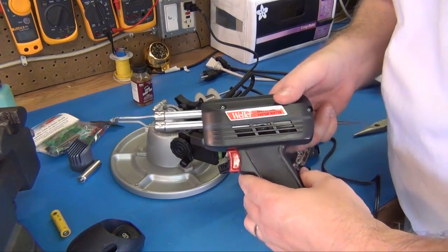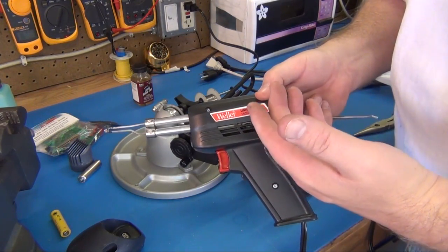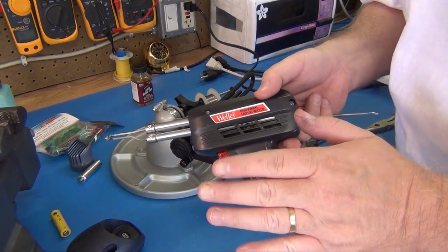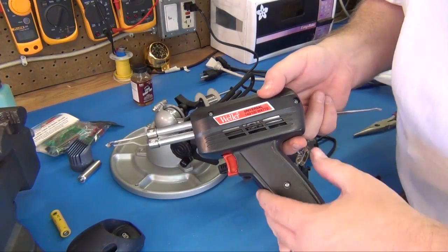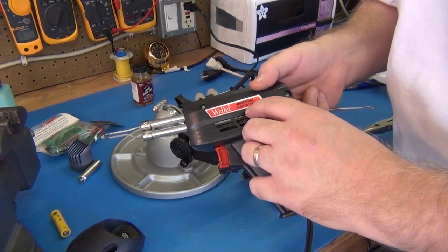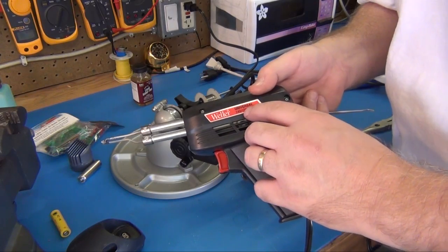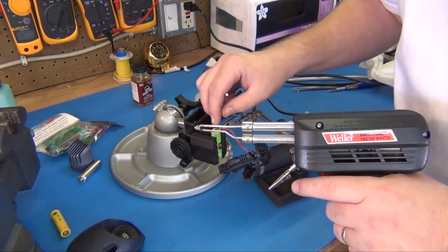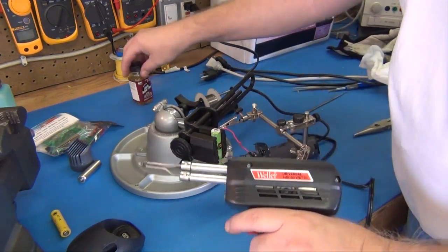To heat it up really quickly, we're going to use a nice big Weller gun style soldering iron, so we can get a lot of heat on it really quickly, so the internal battery doesn't have a chance to actually overheat. This is a 100 watt, or 140/100 watt universal Weller solder iron. So we'll start off making sure everything's lined up good. One last thing for prep.